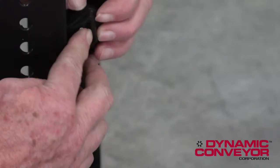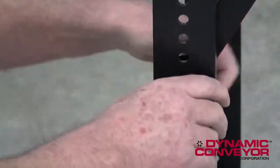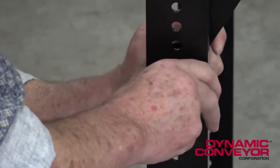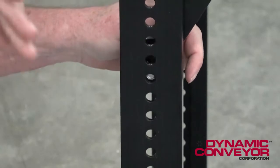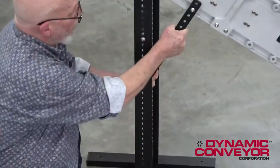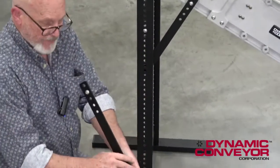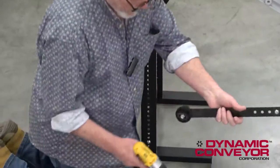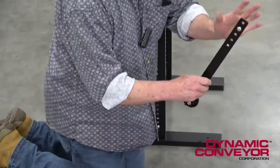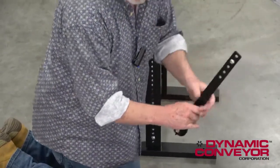Okay? And then as you swing this over to your tube, poke it in there good and tight, and then as you tighten it down, you want to visually watch that cam flip over 90 degrees, all right? And that's what tells you that you are absolutely 100% secured. You just want to watch that cam flip. It pretty much all starts with having this bolt flush with that nut, getting it located, and then just easily tightening this up while you watch that cam rotate.